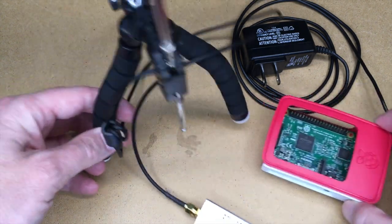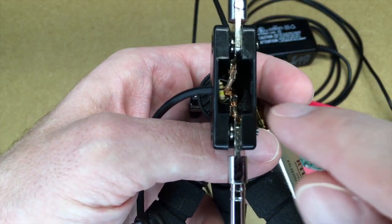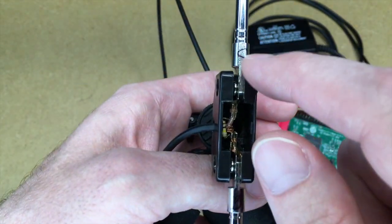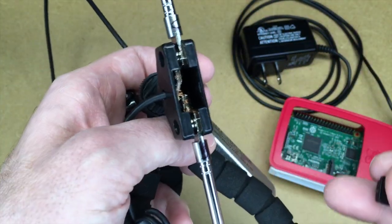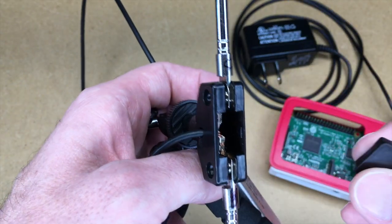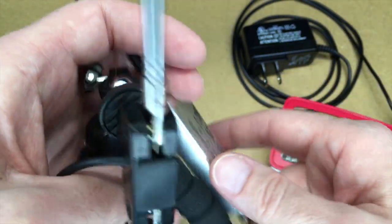I have the antenna here that came with this kit, and this is the configuration I have it in. If you pry open this middle section, you can see one of the wires is connected to the middle of this cable and the other is connected to the ground. I have the ground down and the other one up, using the short leads. I'm not an expert at software-defined radio, so I'm mostly sharing my experience. If you have any suggestions on this antenna, drop a comment below. You can get specialized antennas that will work better than this, but this seems to be working pretty good for me.